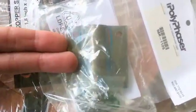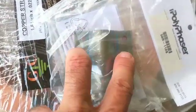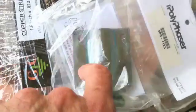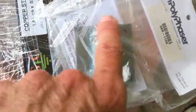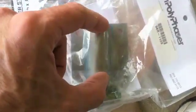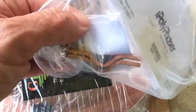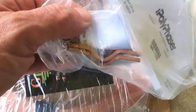What you do is you have your clamp here, and you feed the strap in between this and the ground rod. When you clamp this down, it's got a real nice tight fit — to this whole plate area — and you'll have the anti-ox on the inside of it. That's giving you a really nice press, about a third of the way around the ground rod on each ground rod. So, pricey, but worth it.